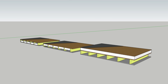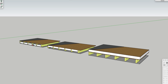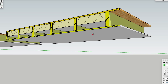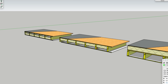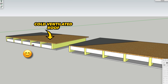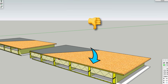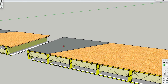Let's look at these examples — only one of these roofs is built correctly. We have cold roof, warm roof, and what a lot of people call a hybrid roof. Tracing the way the air transfers through these envelopes, we can see that our misty windows — our condensation — are going to occur at the temperature drop-off. Whether or not our vapour barriers did a great job, there's always going to be some residual vapour in the air as it travels through, and it's going to condense where the temperature changes rapidly. For a cold roof that's okay — the ventilated void uses negative pressure to suck all that condensing moisture out through the vents.